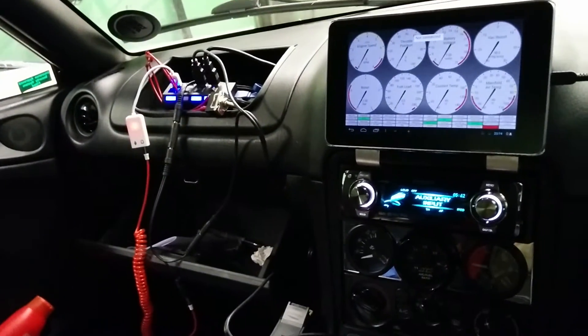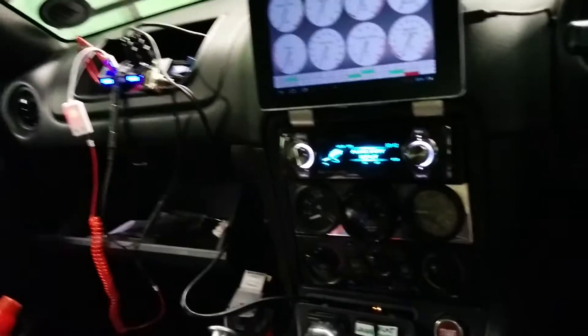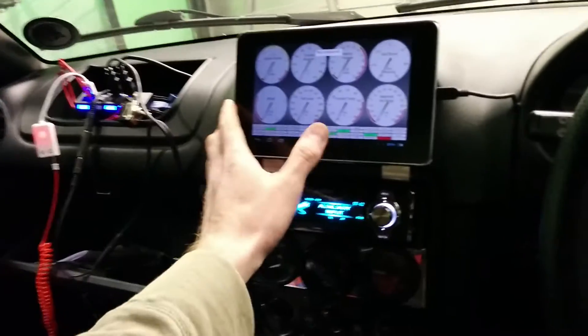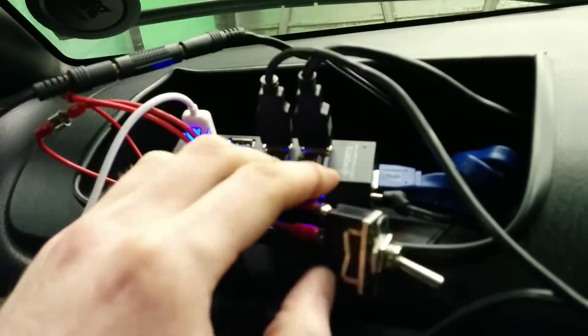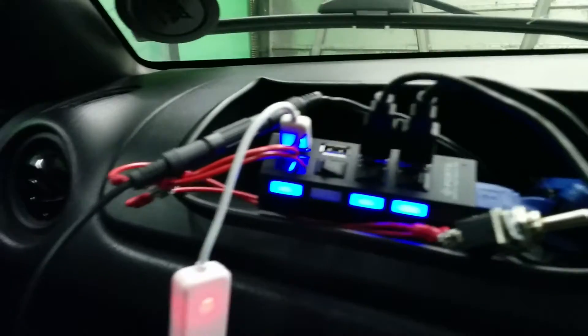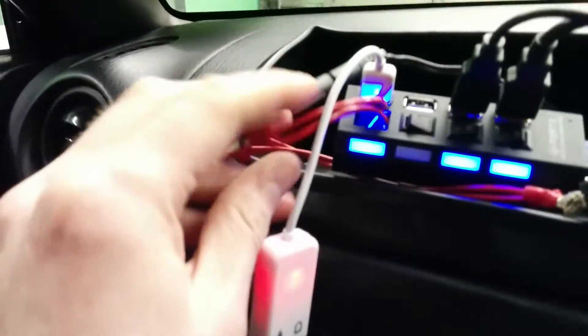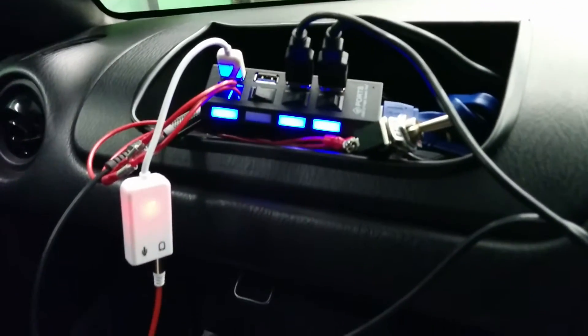But even more wires — it's a stupid problem really, but it was just me being greedy wanting to have aux inputs. It's just a USB 3.0, four-port hub. I did have a seven-port but I couldn't really separate it from the case. This one was nice and easy — I just soldered on two wires and gave it their own spade connector, so I can run any length cable and any switch later on.